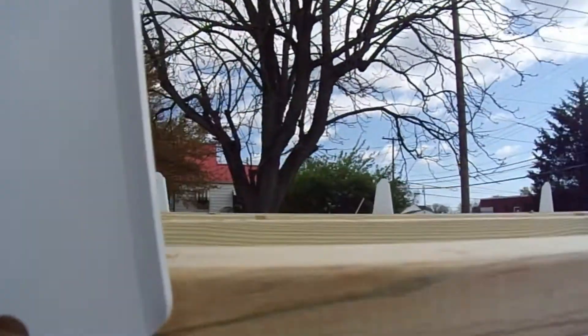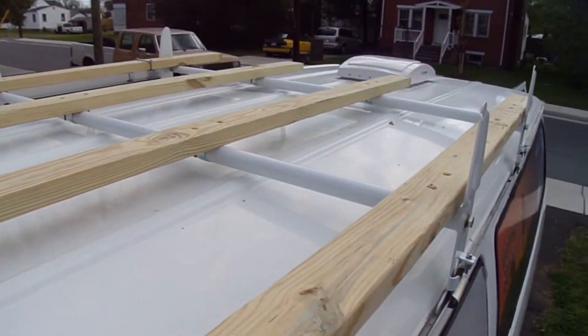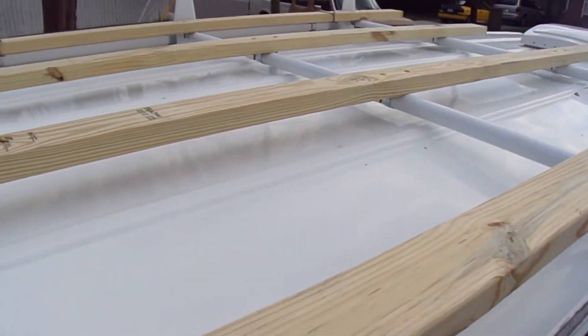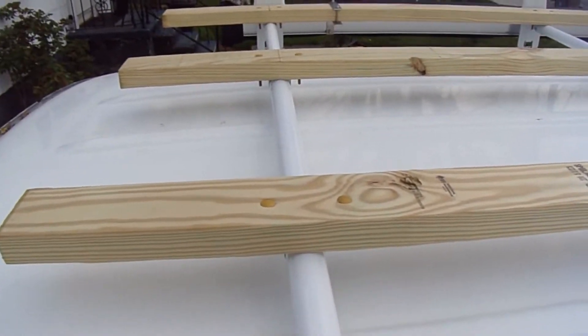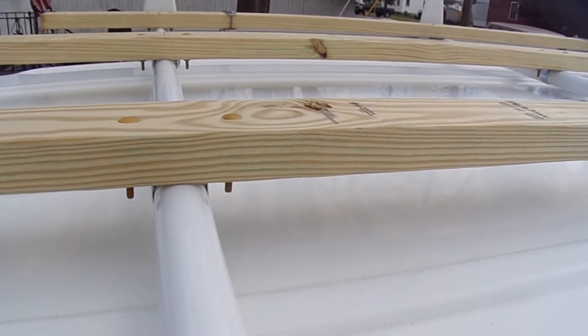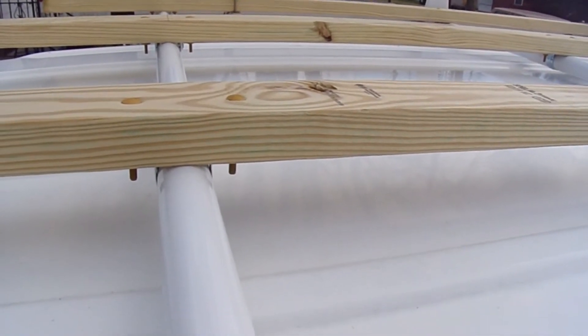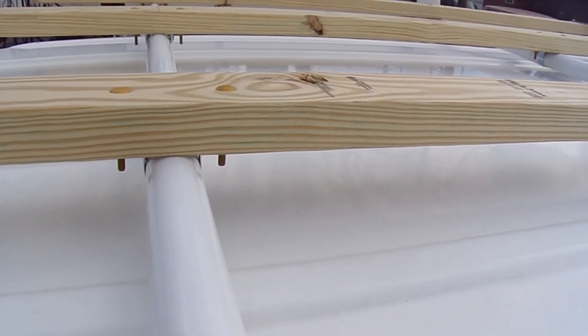So this is what we're looking at up here. They're 24 inches apart outside to outside. I figured with the panel being 19 and a half inches, and then an inch and a quarter for each one of the brackets — so that's two and a half inches — 22 inches is going to be good.